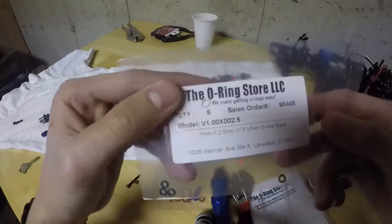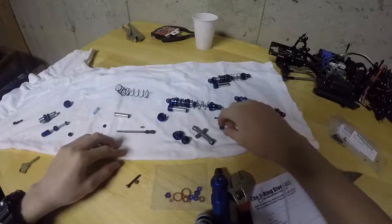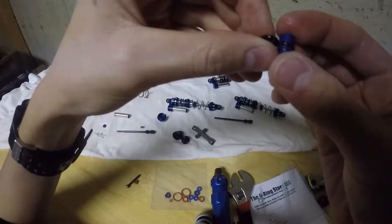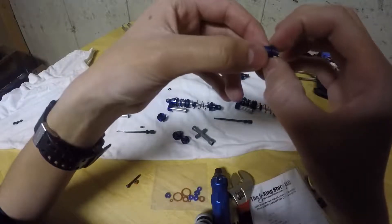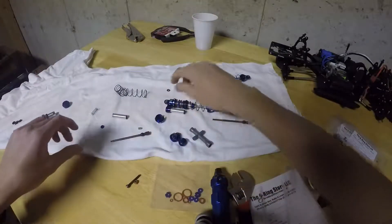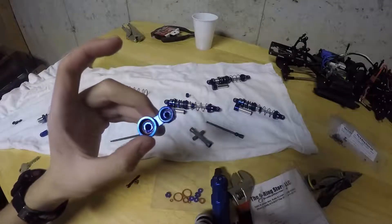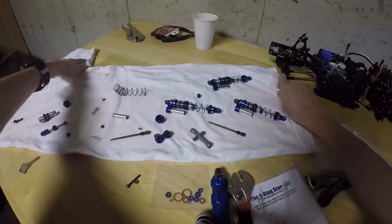I ordered them from this company and they shipped really fast — they have a ton of sizes and materials. The Viton material is slightly more chemical resistant than Buna-N, which doesn't really matter much. It's also slightly better for compression set; they both work well though. That's why I chose it, and it was only slightly more expensive — like $4 versus $2, not much of a difference. And I'll put the exact sizes and links to this information in the description. Also, what I found was silicone O-rings are not well suited for silicone oil, which is strange but that's based on my research.